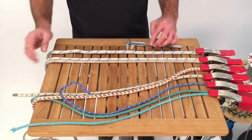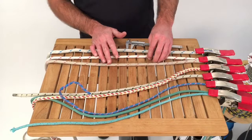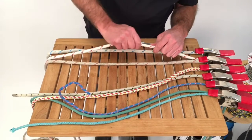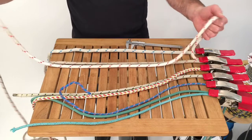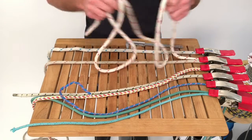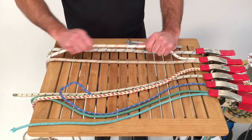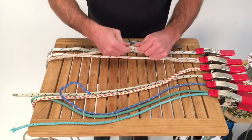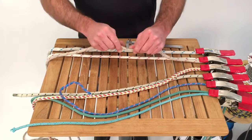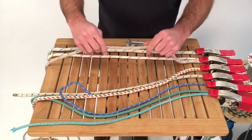Okay, here's an interesting one, this is the same line, just different ends. This must have been a halyard, with this being maybe in the mast all the time, or I'm not sure. No, it's the bitter end, so probably in a sheet bag, not being used. This looks almost brand new. This looks like it's had a good hard life. It feels soft, chalky, so a lot of the flexibility's gone.